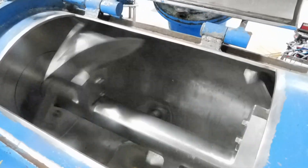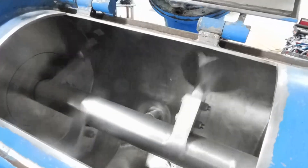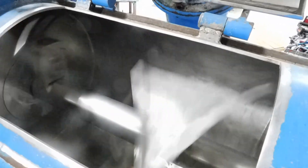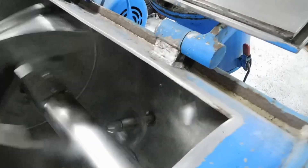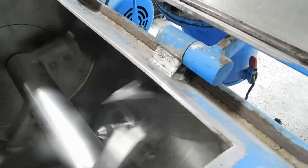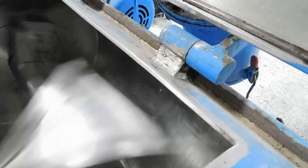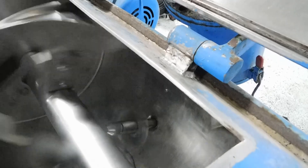A lot of you are familiar with these — they run a little faster than traditional blenders like paddle or ribbon, so they create a turbulizing action. See in the back there, there is a shaft that has the chopper on it with the tulip type blades, and they're traveling at high speed, which is why you can't see it. We're going to shut that off so you can get a quick look at it.